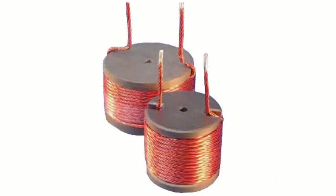These coils have a higher Q-factor in the same dimensions. This can be attributed to the more effective use of the total cross-section of the wire-forming strands, as AC flows mainly on the conductor's surface. Litz wire uses more woven wires with the same cross-section area.